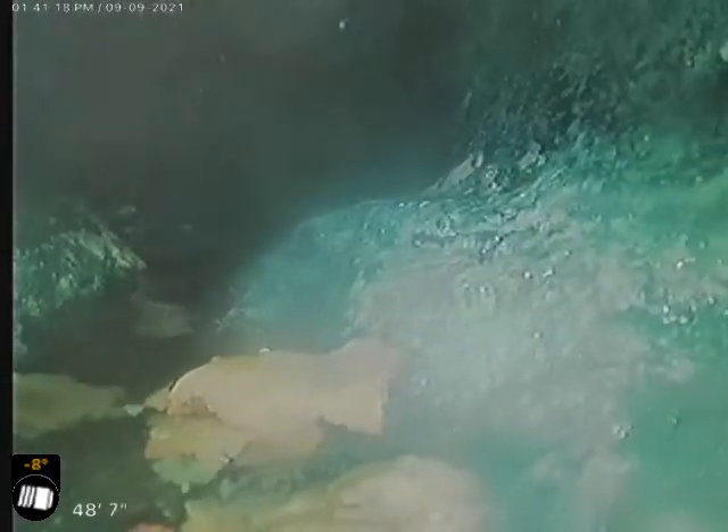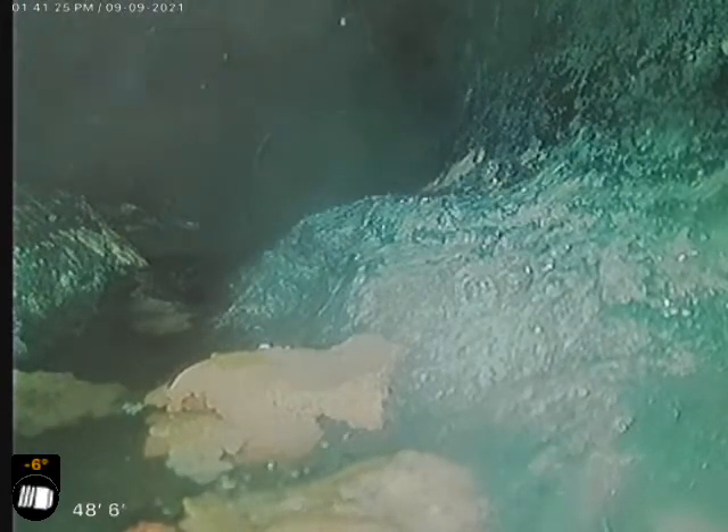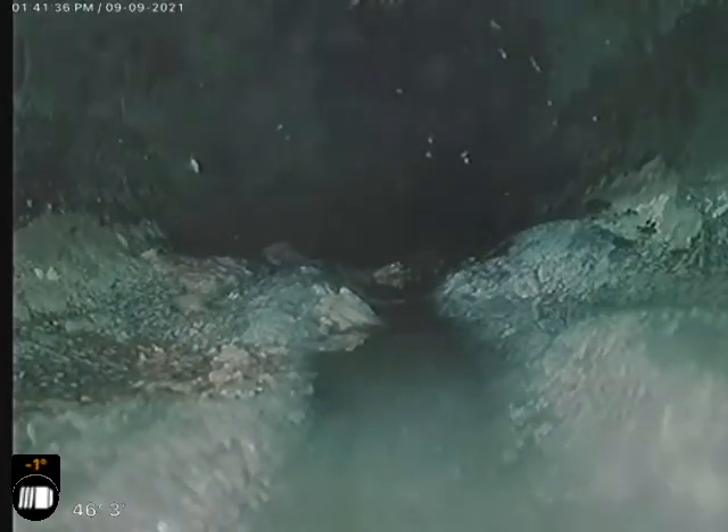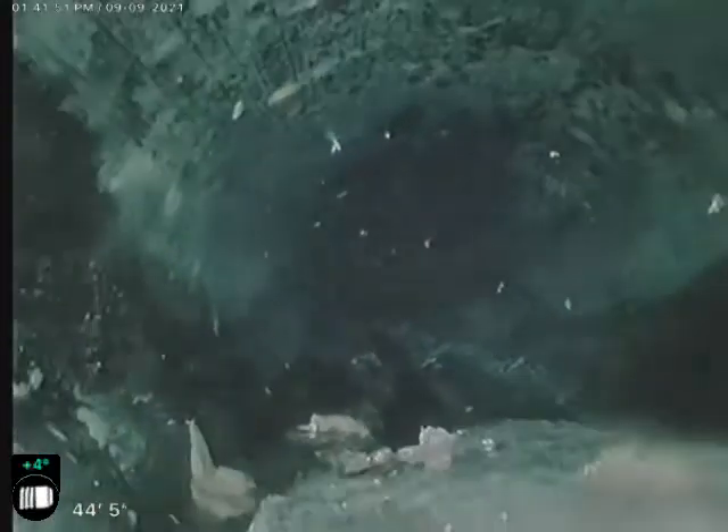Let's go through this part slow. Right here we run into a little bit of belly and we transition to a different type of pipe — I believe this is Orangeburg pipe. Orangeburg is basically a cardboard tube with pine resin, and you can see the humps that it's creating in the little pits. That pine resin deteriorates and then it starts absorbing into the pulp and paper, causing these humps, these bellies, all this stuff. You can actually see right there there's a hole in it — got a lot of these humps and holes. You can see we're going into a big hump right here and we popped over the top. Right here's the spot that we were struggling to get past with the big guide ball because of this large hump.